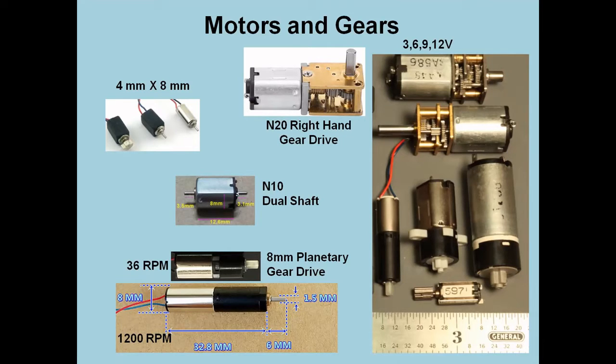It's a tiny 4x8 millimeter motor. And on the end of it, there's an off-center weight. And as it rotates very, very quickly, these things tend to have like 12,000 RPM associated with them. When you weight it down, they don't go that fast, but they will generate the vibration. And that's why the off-center weight. It turns out if you look closely here, you can't really see how that weight is attached. Well, originally it starts out fitting very easily on the shaft, which is about 0.6 millimeters.